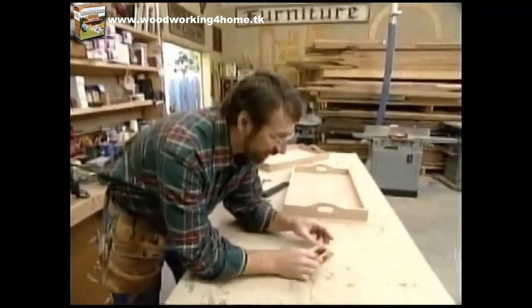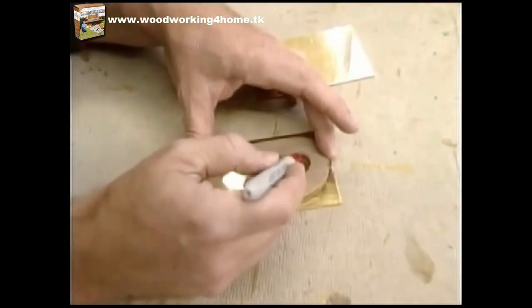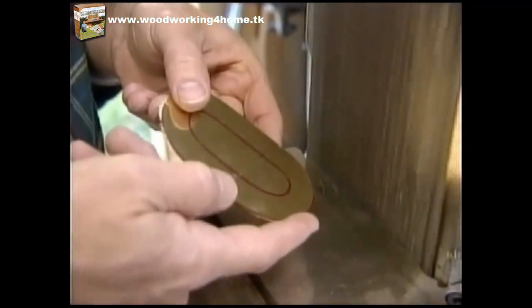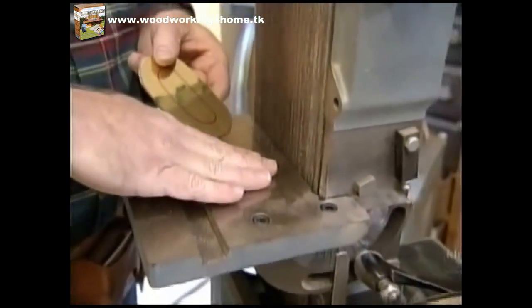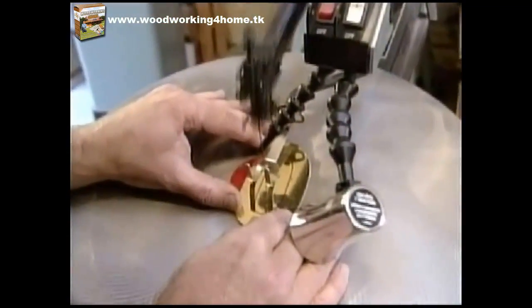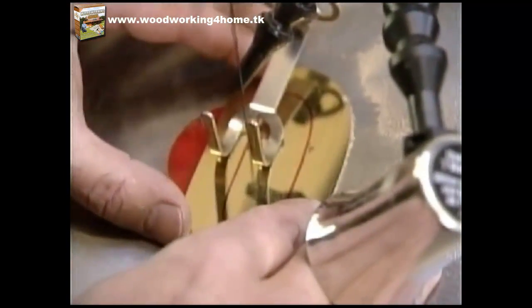For the brass that surrounds the hand holes, I've made a plywood template and I'll lay it out on the brass using a permanent marker. I'll cut the outside on the bandsaw and the inside on the scroll saw. To refine the edges I'm using my sanding center to remove the layout marks. I've also tilted the table in just a bit to give a slight back-cut to the face side so it'll fit tighter in the mortise I make later. My scroll saw can easily handle this brass.